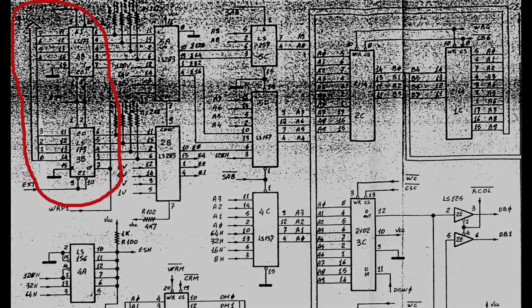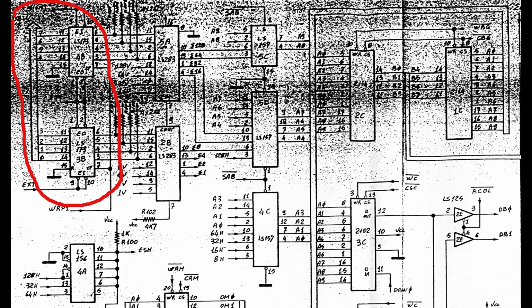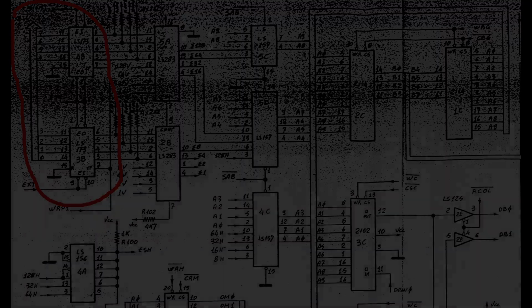Anyway, the first thing I want to check on this board is whether or not the main CPU RAMs have issues. So, before I figure out exactly how to write things on the screen, I will be just using some output bits to indicate if the program finds errors or not. I'm going to use these two 74LS173 latches that the CPU can directly write to. These contain 4 bits each, so I'll write a 0 on the latch bit corresponding to a RAM bit giving an error, and a 1 otherwise.